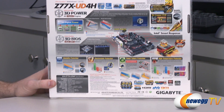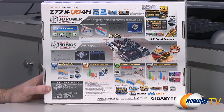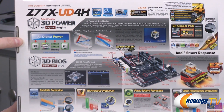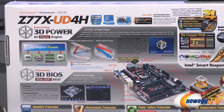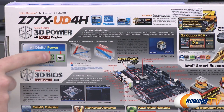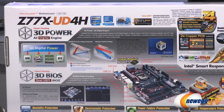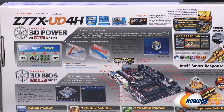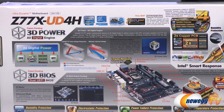Around here on the back we have some more details on those features. The all-digital power is providing digital power delivery to the CPU, the HD graphics inside the CPU, the memory, as well as the power delivery for the CPU and the iGPU. We also have a digital engine that provides faster response time, and load line calibration is supported if you want to enable that feature.